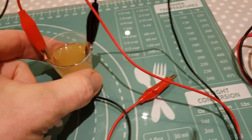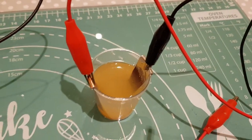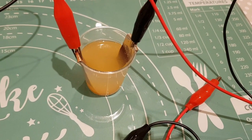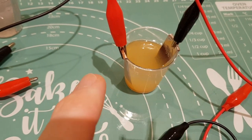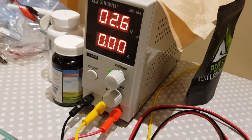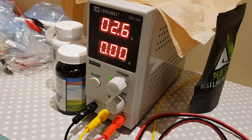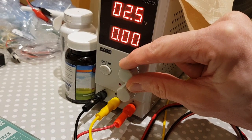The first one is basically distilled water — just the common garden variety you can buy anywhere — about 20 millilitres of distilled water with about three grams of the calcium chloride powder mixed in. We've got the aluminium foil on the negative and the copper on the positive electrodes, and you can wire this up to my DC power supply.